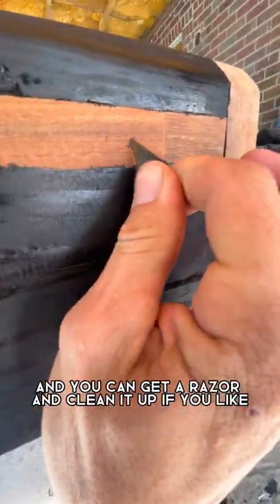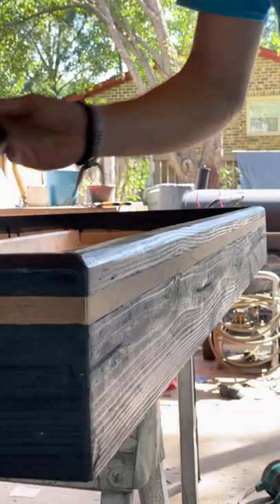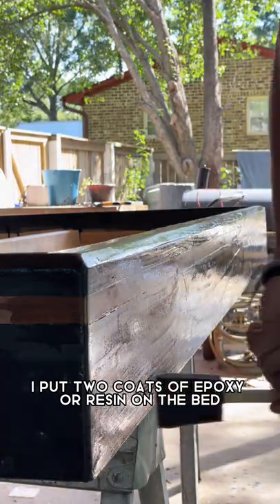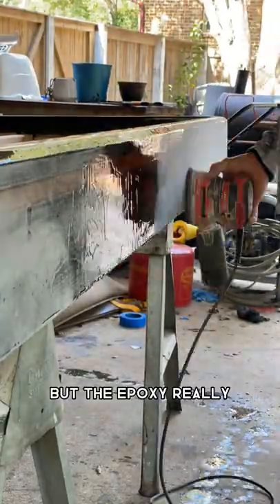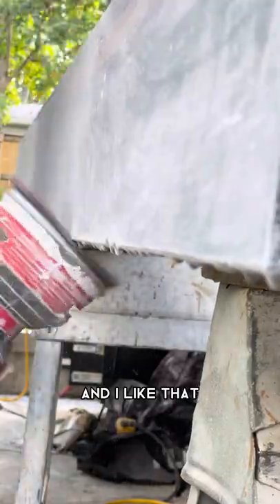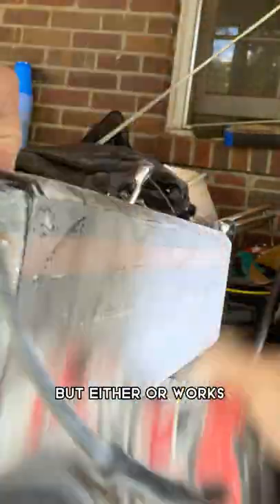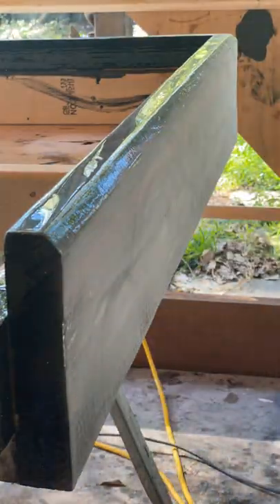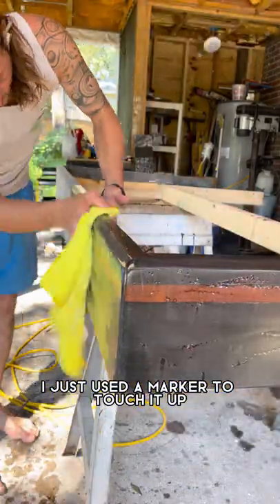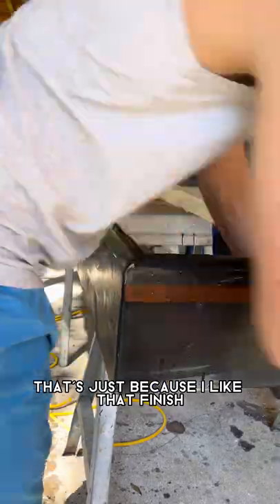There are some imperfections at the tape line — you can get a razor and clean it up if you like, though I only did that for very obvious spots. I highly recommend the next step: I put two coats of epoxy resin on the bed. You could go with just polyurethane if you'd like, but the epoxy really protects the bed over its lifetime — it's a much thicker finish. I sanded from 120 down to 400 grit. I did over-sand a couple of spots but since it was black I used a marker to touch them up. Then I did one final coat of polyurethane semi-gloss after the epoxy was sanded — I just like that finish better than raw epoxy.